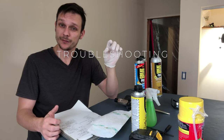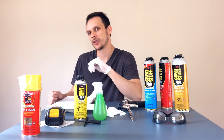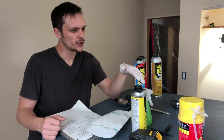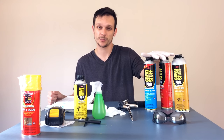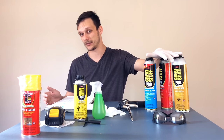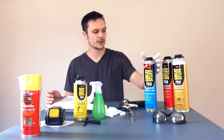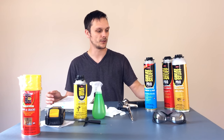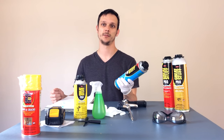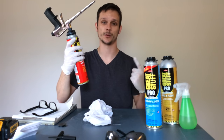A little troubleshooting: if your foam is actually shrinking instead of expanding, what's most likely happening is that there isn't a high enough moisture content in the air — that's where you'll definitely need the water bottle. A foam malfunction or failure is more often a problem with the environment you're spraying in than the actual foam itself, though it could be defective. More often than not, it's going to be your environmental condition. Different types of foam have different application temperatures and relative humidities — make sure you read the instructions. For example, this window and door foam needs to be sprayed above 40 degrees with a relative humidity of at least 50. Too low relative humidity or too cold and it won't work. That's how you use a Pro 14 foam gun.